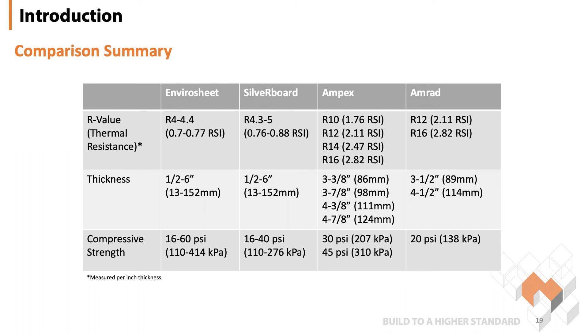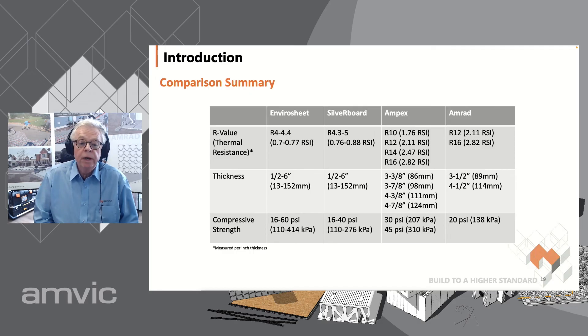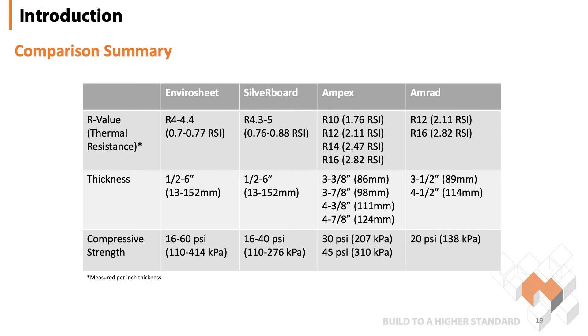This slide is essentially a summary of the key aspects of all the products just mentioned to allow for a quick comparison. In some instances the products can be interchanged, but ideally we try to provide the best value product for the correct application, giving you a streamlined installation process that is simple and clear to follow while providing all the benefits of an insulated slab. One important thing to keep in mind when figuring out what thickness of EnviroSheet or Silverboard is needed is that the stated R-value is measured in one-inch increments. To figure out the total R-value, take the desired thickness and multiply by the R-value per inch — or work in reverse to figure out thickness if you know the target R-value. If uncertain, please feel free to contact us.